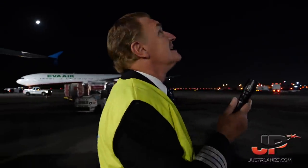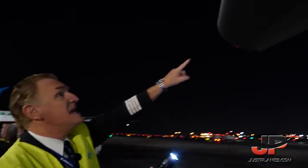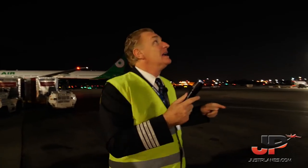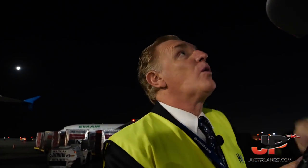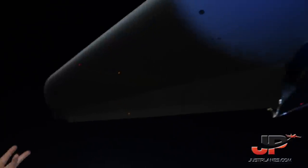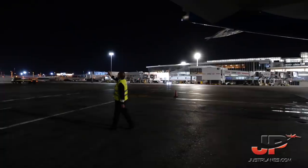Horizontal stabilizer is 31 meters wide. This is the wingspan of an old 737 or probably an A318. It can hold on the trim tank 18 tons of fuel. This is more than the fuel capacity of an A320. We use this fuel for balancing, CG working. It only transfers the fuel forward, not aft and forward like in the other Airbus models, 330, 340.